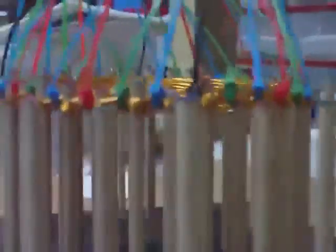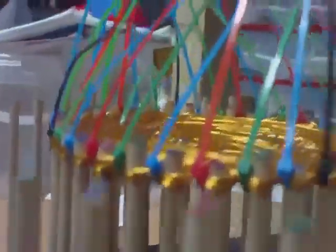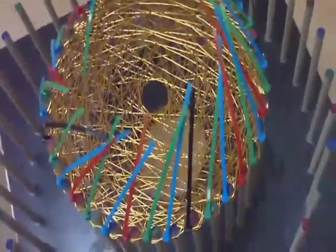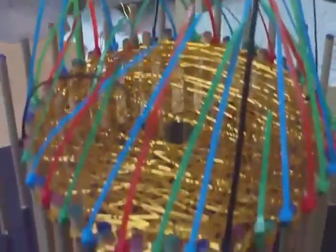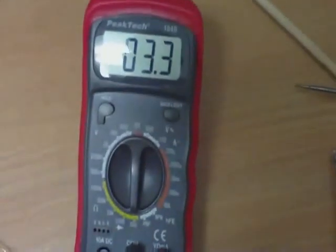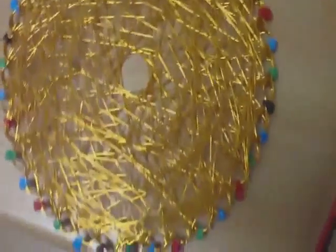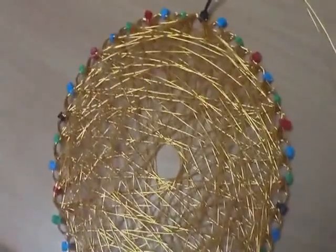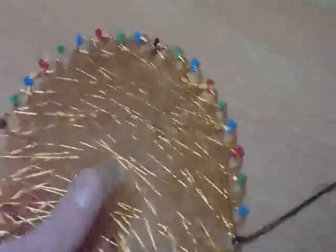Finished all the zip ties here, looks quite good, nice coil. But what really annoys me is I have no idea where my zip tie gun is, so I had to do this off by hand. That is the finished Starship chalice coil. The meter just says 3.3, the measuring cables have about 0.3, so I would say 3 ohms exactly for one winding — one wire Starship chalice coil. It is a beautiful coil, looks like a piece of art.